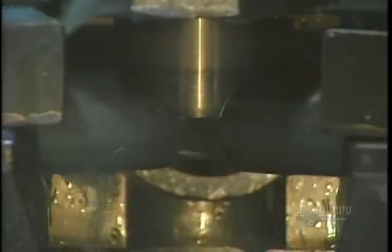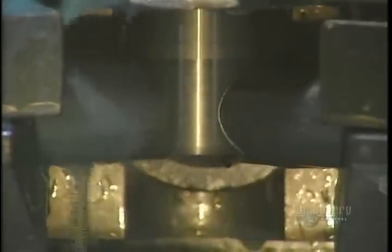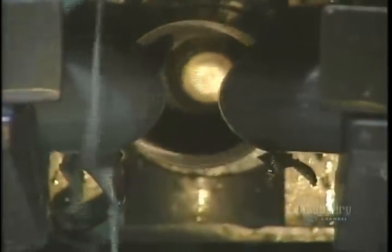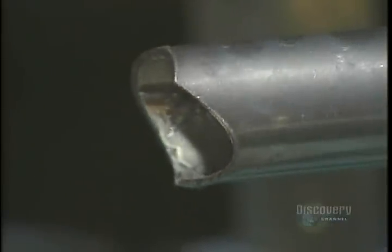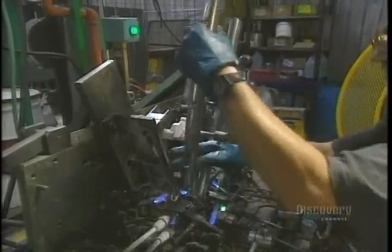The tubes must now be machined, that is, cut into lengths so that they correctly fit into one another. During this operation, cutting oil cools the tube. The tube is cut, taking into consideration the insertion angle of the other pieces. Tubes to be welded together are placed in this support.